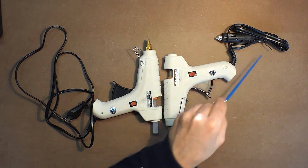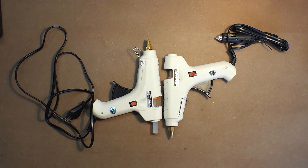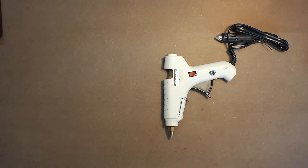But because of this car plug, we can suppose that the device is designed for vehicles, and their internal operation voltage may vary from 12 up to 24 volts. But anyway, according to the inscription, here we have 12 volts. And taking into consideration this automobile plug, we can conclude that the device can operate in the voltage range from 10 or 11 volts up to even 13.5 volts. So if this device cannot provide the corresponding heating at 12 volts, it will be operated on 13.5 volts. And exactly that's why the following 12 volt batteries are not acceptable in this case.